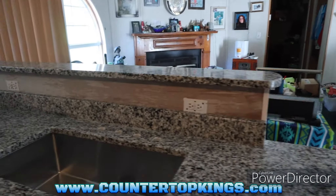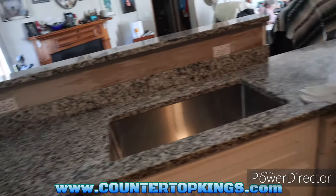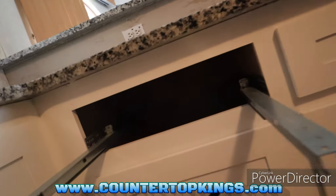We are finishing up everything here. Got the sealer on. I still have to go over the aftercare with the customer and run some painter's caulk around. The cabinet guy scared the customer about taking drawers out, told her they were very hard to get in. But anybody that does granite knows that when you have a seam you have to get to the underside of it — you have to get in there to put some epoxy on the bottom side of the seam. Also over here I had to get a bunch of shims up in there because this side dropped down quite a bit.